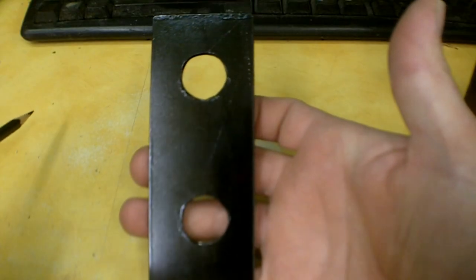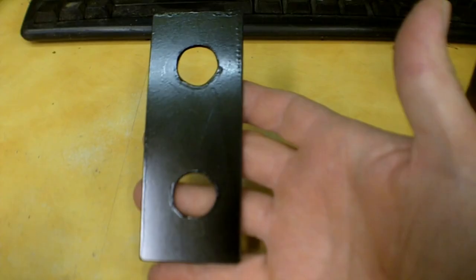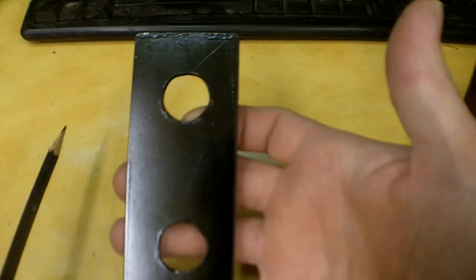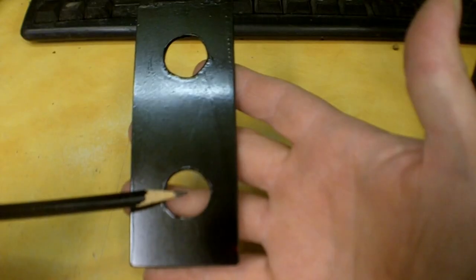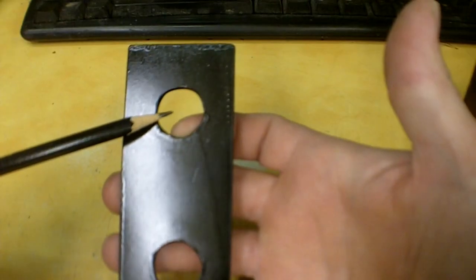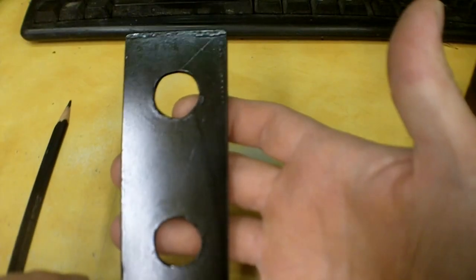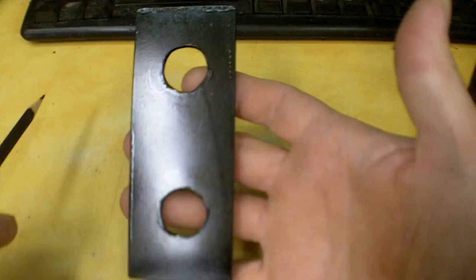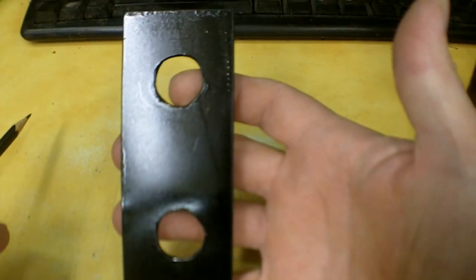I've made the shim. It's not too much to look at, but it's function before fashion. Just to give you some dimensions: it is two inches wide and four and seven-eighths inches in length. From the bottom edge to the center of the first hole is one and three-sixteenths inches, and from the center of that hole to the center of the next hole is two and a half inches. These holes have been pierced at thirteen-sixteenths inch in diameter. I went out in the pitch black dark of night and dusted it with black paint just to help prevent a little bit of rusting. So that's what it is, and it's going to work just fine.